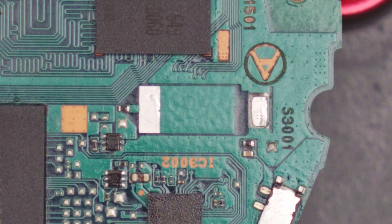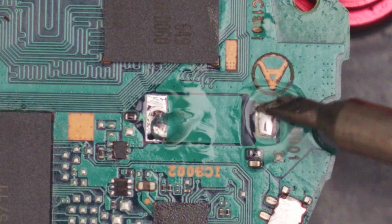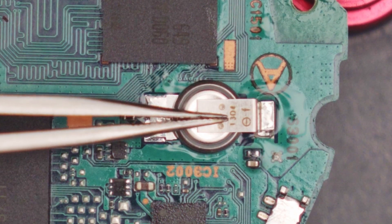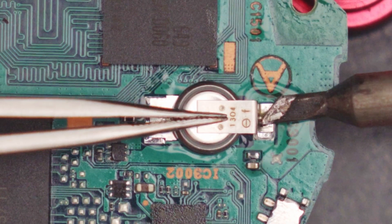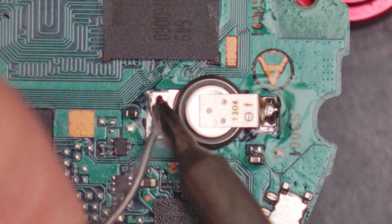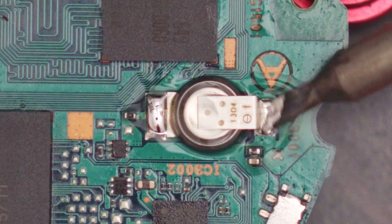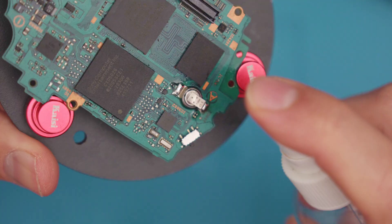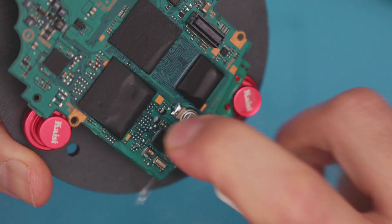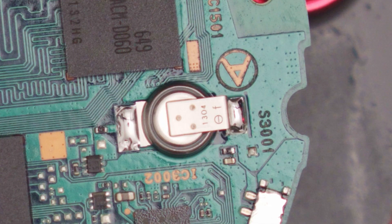And this should be the end result. Now go ahead and add a tiny bit of flux to these pads, a tiny bit of solder, place the new one right on top. While holding it in place, go ahead and heat up these pads. Once one side grips, you can go ahead and flow it with some solder, followed by some more flux. And you're pretty much done. Now do the classic clean up.